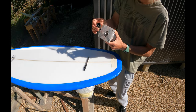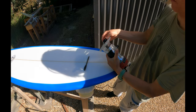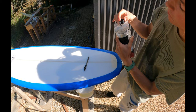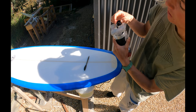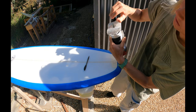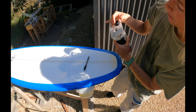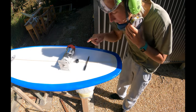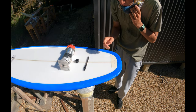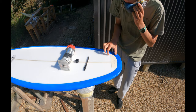Now the step of setting the router's depth — how far down it actually digs into the board. Mine's preset. You want it to go to just above the little nook so it sits down nice and deep, and the little stoppers should stop it from going any deeper. Just set your router depth so it cuts just above that. Also, make sure to tape off a little area and draw onto the tape — this keeps resin from spilling outside your cut area when you glass it in.